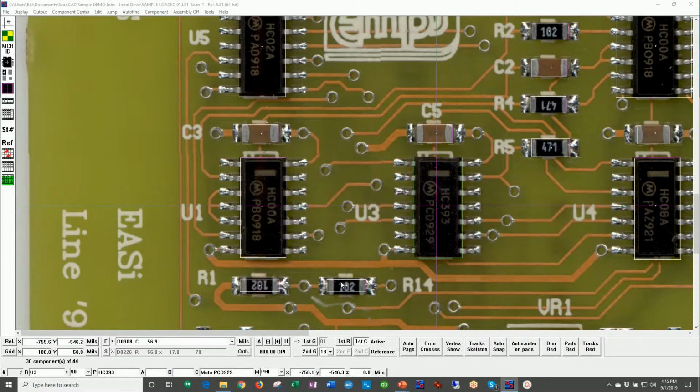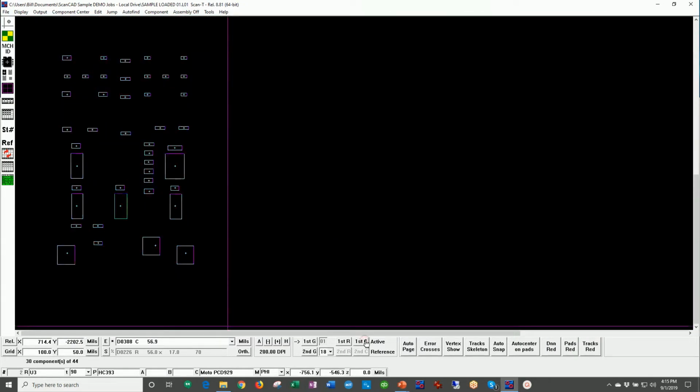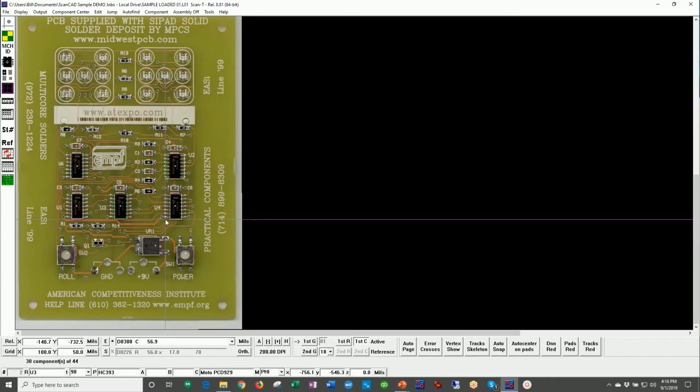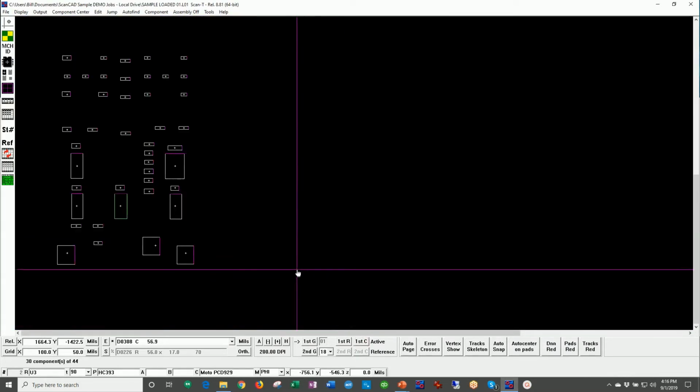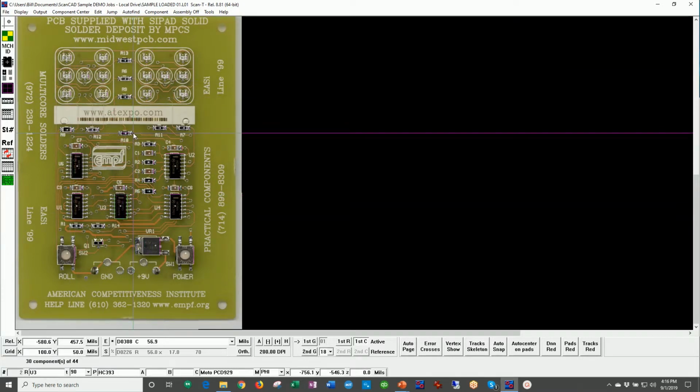Okay, so that is the ability to overlay CAD data and BOM data on top of a populated board and perform really more of a manual inspection. This is not meant to be an AOI system for component inspection or for inline solder paste, but it does a phenomenal job of first piece, new product introduction, and product changeover situations. So we can actually look at parts, make sure things are rotated properly, etc. Again, making sure all the pieces come together in a perfect way.